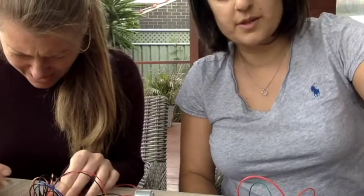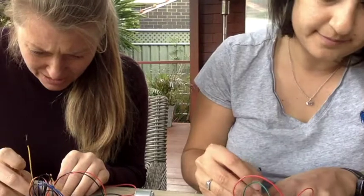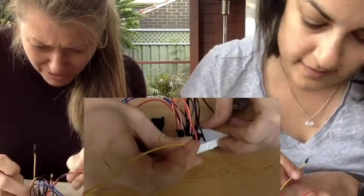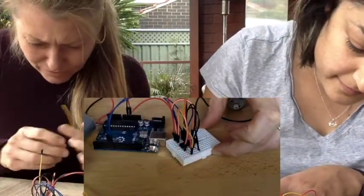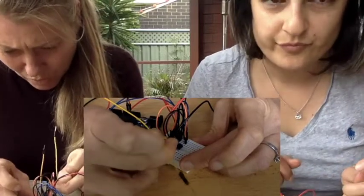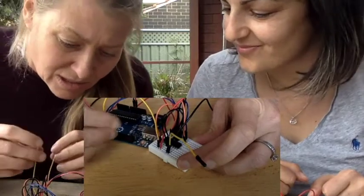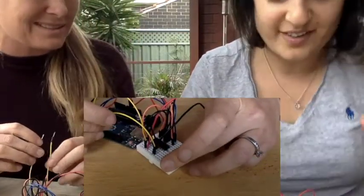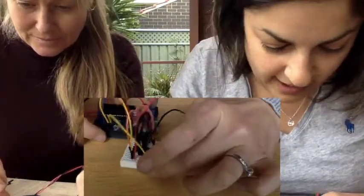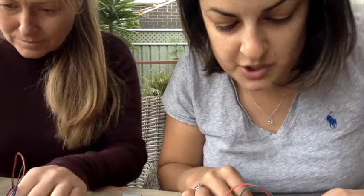For the left motor, I'm going two from the bottom and two from the top on the chip. I'll put the yellow wire into A9 — that's two from the bottom on the outside — and then A4, which is two from the top. I'll connect those to Arduino digital pins 8 and 9.